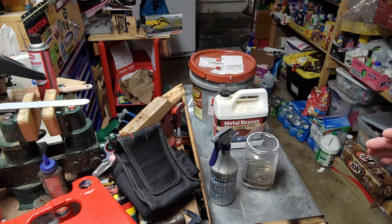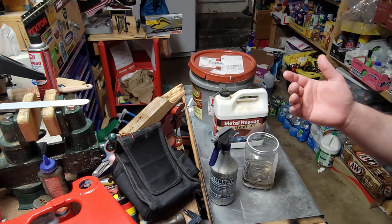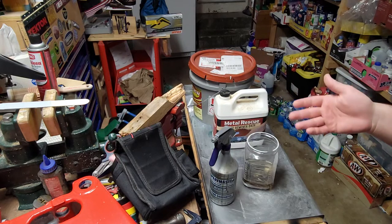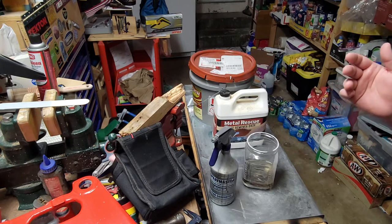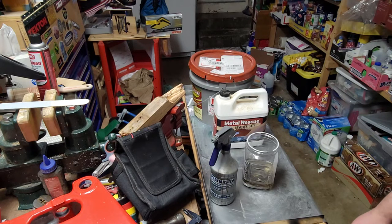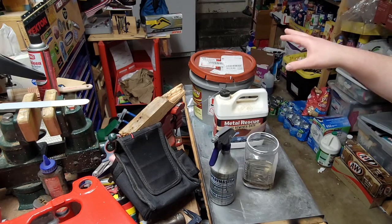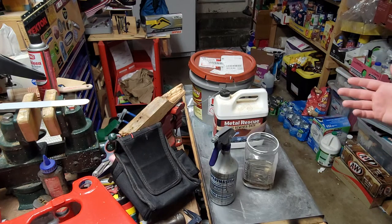And so by the time you get done with that process of removing the oxidation, the rust, put water on this to rinse it off, and then go to dry it, and then apply whatever finish you're going to put on it, it's already flash rusted everywhere. And so I had that entire saw cabinet done. It was completely rust-free. I rinsed it off, and within an hour, the entire thing was just surface rust all over it. I almost left it because it kind of looked cool, but it was sitting on its back at the time, and so it would have all looked kind of weird, not vertical. If it had been standing up, I would have considered just leaving it, because it looked a little bit interesting. I still would have been extremely mad at the idiots that made that and then said, oh, wash it with water,